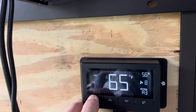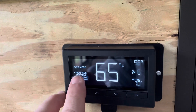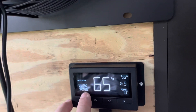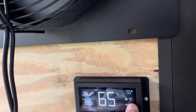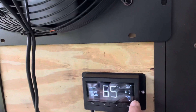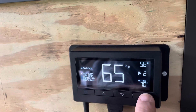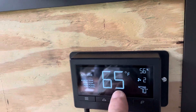I'll show you some of these other settings. It can be automatically triggered at a high temperature point, a low temperature point, a high humidity point, or a low humidity point. Notice what it's done as I've taken it off — it didn't just stop from mode 10. It's slowly ramped itself down. It's at level 4 right now, almost off. My high temperature activation is set at 70 degrees. It's reading 56–55% humidity right now, 65 degrees Fahrenheit.